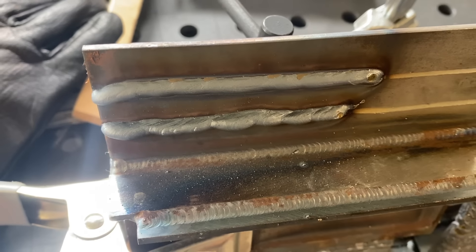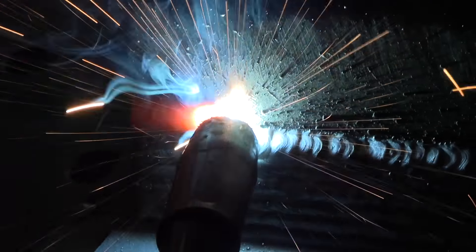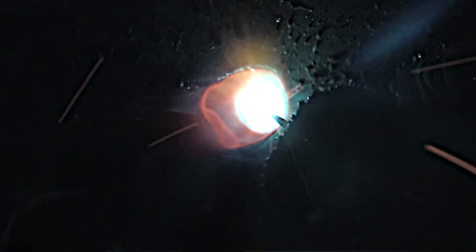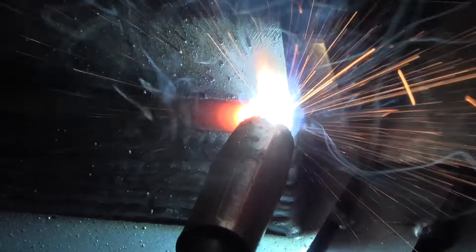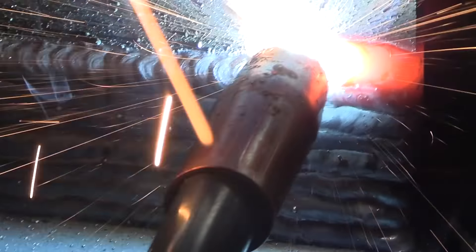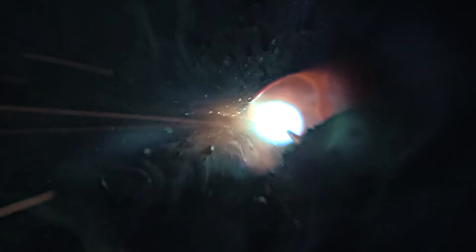A long stick out totally changes the arc characteristics and can make a weld pile up — you see that bottom weld all piled up there? I'm still welding at that fairly low wire feed speed of 173 inches a minute, and the machine is reading out anywhere from 110 to 115 on the amperage. When I see an amperage readout on a MIG welder, I automatically compare it to a 7018. That would actually get the job done here on this 3/16 thick plate — it might be a little on the cold side, but it would get the job done. So there are some similarities in MIG welding and stick welding if you're looking at the amperage readout. It's not the same — it's apples and oranges because with a stick welder with 7018 you have flux, so you have some chemistry going on that aids in fusion. But it's just a reference point.